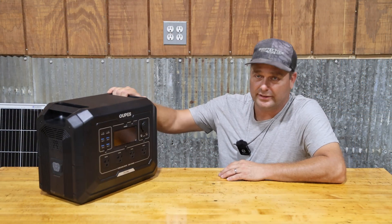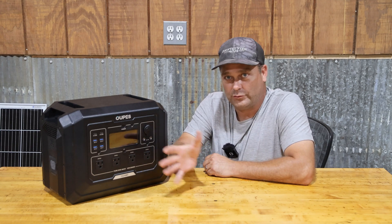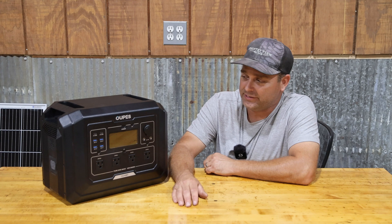After testing the Mega One, I think it performed exactly as expected. We couldn't measure the 4,500 watt max surge — using an amp clamp, it could be happening so fast the meter isn't catching it. But we do know it was putting out around 24 to 25 amps of continuous output for three to four seconds, which I think is pretty good surge capacity.